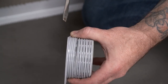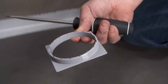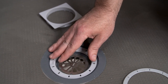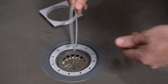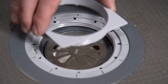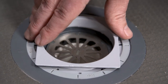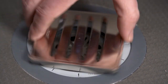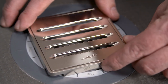After measuring for the thickness of your tile assembly, cut or snap off the extra threads of the extension collar. This will still provide plenty of adjustability even when all perforated threads are removed. Clean any debris from the drain area prior to installation of the two rings and extension collar. Place alignment ring one in place, followed by snap ring two, lining up the indicators on both rings — this will screw into place. Be sure to adjust to the correct height before tile is installed around it. The drain cover then gets placed on top of the extension collar. The WEDI click and seal drain allows for movement of the drain cover 3/16 of an inch in all directions, providing perfect drain cover placement when installing tile.